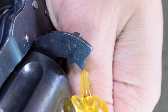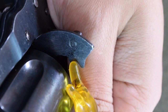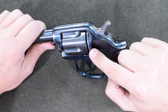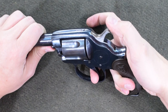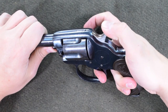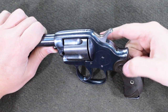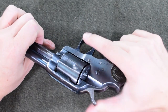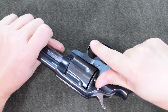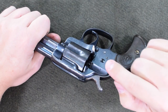Take a look at this little tooth — not this one, but down in here, this little tooth. He's actually a separate part of the revolver, serving a very critical role. Without him in place, let me show you: with the gate open, indexing this cylinder — she rolled over just fine. Did you see it roll backwards? So I shot round number one, now I'll shoot round number one again, and again. I'm going to forever shoot the same singular round. That's because with the loading gate open, if I close it and work the gun again: round one, round two, round three. That one little part is responsible for preventing the counter-rotation of the cylinder due to uneven weight and the drag of the hand.